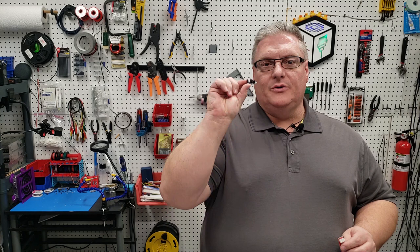I really like the version 1.4 board and I like the turbo even more because I think the performance is a little bit better. This only applies to the Z axis, and if there was one axis that they were going to pick to screw up that you didn't want to have this problem on, it's the Z axis. So many makers like myself use an optical end stop for the Z axis in particular, and the reason why you use it for the Z is that an optical can give you some really good precision and repeatability compared to something like a mechanical end stop.